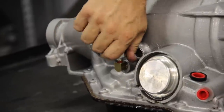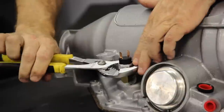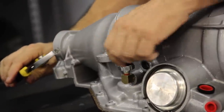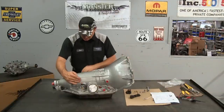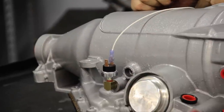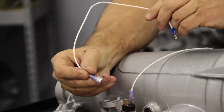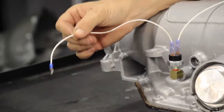The switch already has some teflon sealant on it. Using crescent pliers, grip the metal portion of the oil pressure switch and secure it into the elbow — do not over-tighten, and do not grab the plastic portion of the switch because you can twist it and cause it to leak. Rotate the switch so the rear prong is closest to the case. This allows the ground switch wire connector from your case connector to reach over and snap into the oil pressure switch. There's an eyelet on one end and a spade connector on the other — ground this to the cross member, frame, or any good ground source to complete the ground circuit.